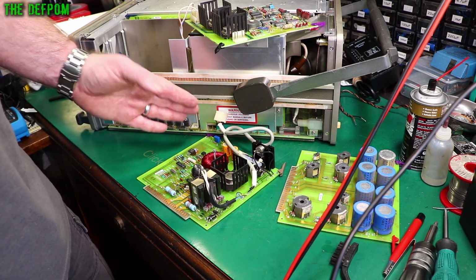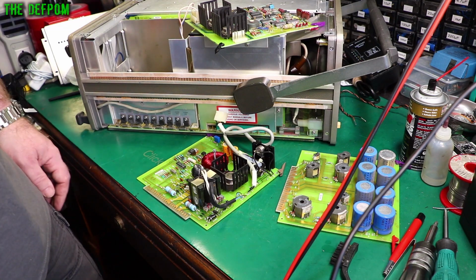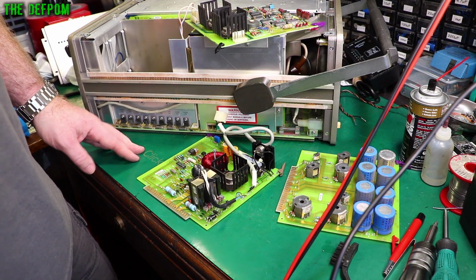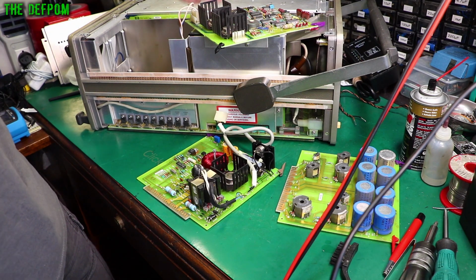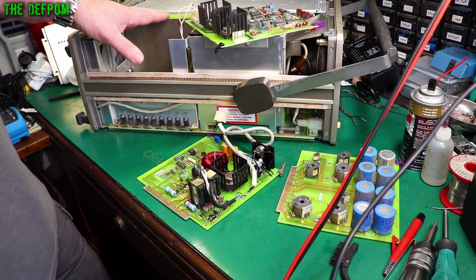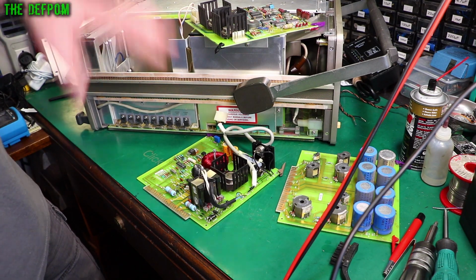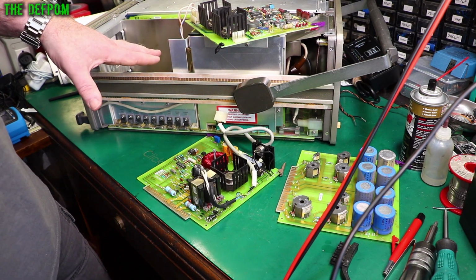I don't know, it could be any of those three parts. But it could even be something those are going to, maybe another card which I've already put back in, which has got a short. Because it's 29 ohms. So 29 ohms could be a distance thing, so it's going to another card somewhere. Actually, I'm inclined to lift boards out before I do that. Now, I've already eliminated all the power supply boards. Had all these boards out. You can see I've got some here already. I lifted the other board out. So all this section here, this block, has all been eliminated already.